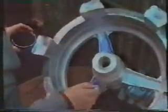After further cooling, the wheel is checked for any major defects. A dye known as engineering blue is painted onto the wheel. As the spirit in the fluid evaporates, it leaves the blue colorant behind to reveal any telltale cracks. The finer cracks, should there be any, are detected by irradiating the wheel with ultraviolet light at a later stage.